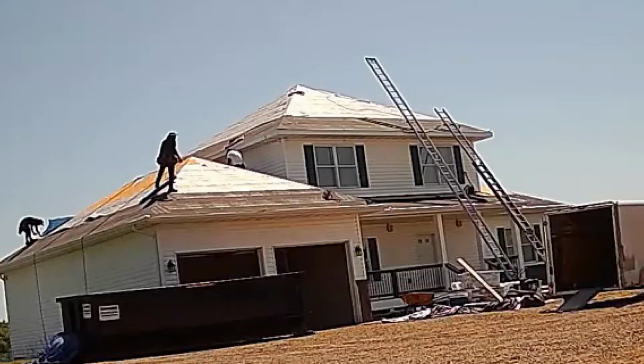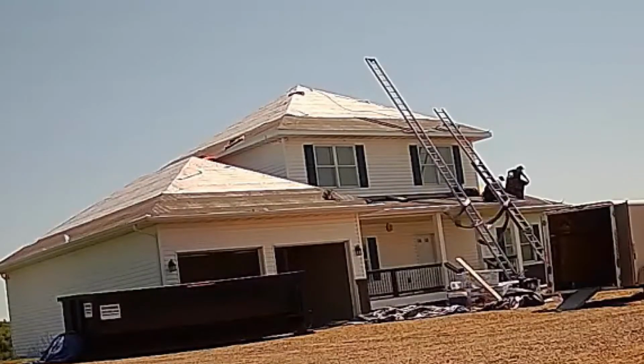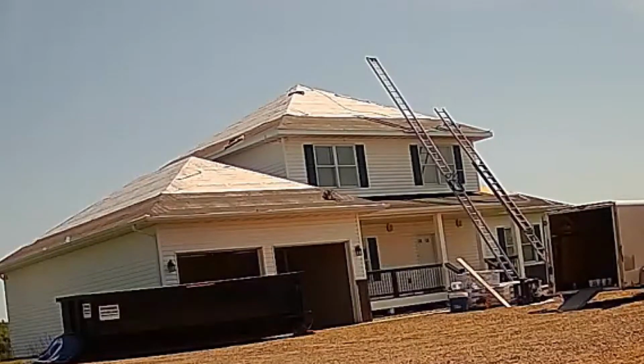They weigh more. The other thing is they've got three glue lines on them versus the old ones had two. They had one on the bottom of the middle of it, so to speak, and then they had one on the top, which grabbed the shingle that would have laid on it. These have three. They have top, middle, and bottom. So I think there's going to be better retention.